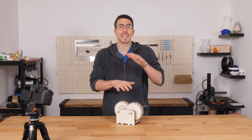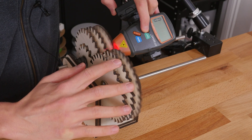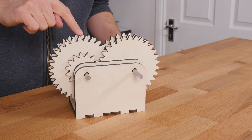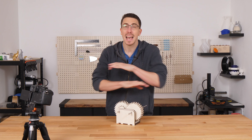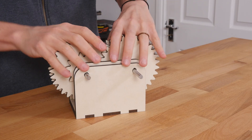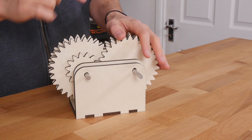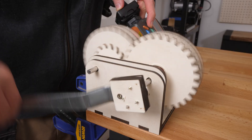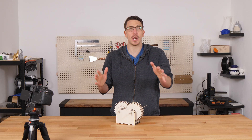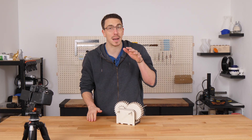This is a lovely little gearbox I've created in just about a day — it's a 1-to-32 ratio, so every time this one here spins once, this back one is going to spin 32 times. I have no idea how fast I can get this to go, so we're going to spin it by hand, then attach a crank, put a drill to it, and make this go as fast as possible. This video is sponsored by PCBWay.